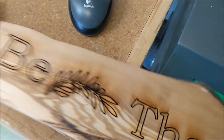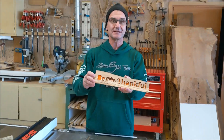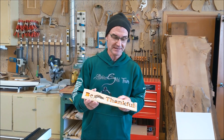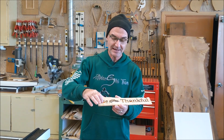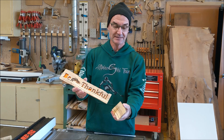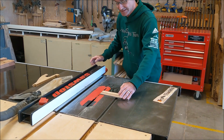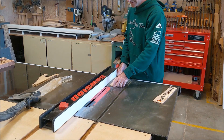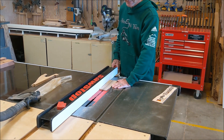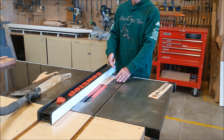I hit play and cut through, then push the pieces out. So this is the olive wood we milled out - I planed it down to a little bit less than a quarter inch. I used the Universal Laser at 3.6 and cut all the way through. Parts of the B I might glue back in, as well as part of the E. For the stand, here's my off-cut - I like that natural ledge. I'll put a dado in there so it can sit like this, with the height of the dado in the middle.